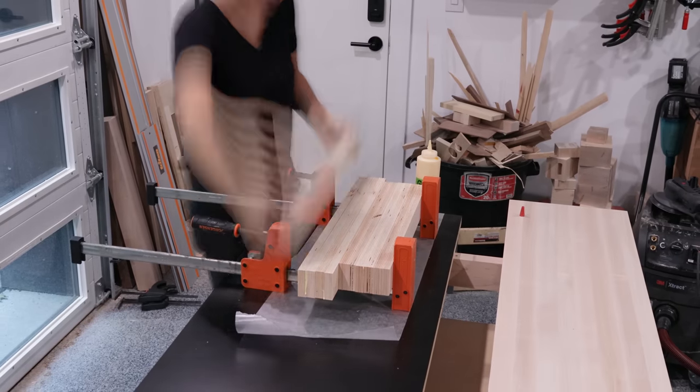To extend the bench: I have a long piece that's longer than my bench when butted up against the dog on the vise. So I use my front vise to create an extension fence. All you need is any long board — put it in your vise, extend it further than your piece, and rest it on one of the dogs on the side of the bench. Then clamp a block to the end of it, tighten that down in the vise, push it up against the stop and secure it with the tail vise. Now this piece that's longer than your bench is secure and you could work on it. You could make something more permanent and screw it, or build something that has support from underneath. A lot of different options, but you're not limited to the size of your bench.